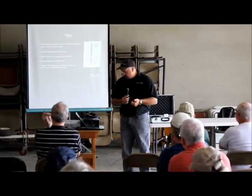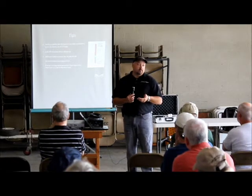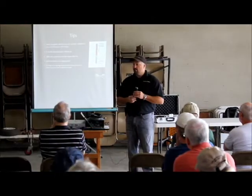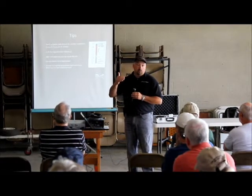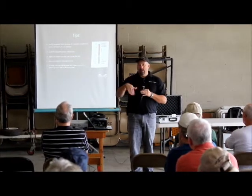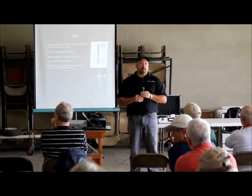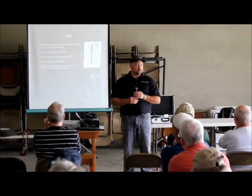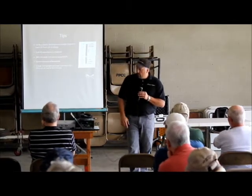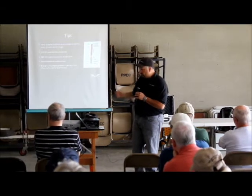1.2 ips is the FAA limit for a required static balance. So if you get an airplane that's got a 1.5 ips reading, that's a lot. I would go in and start doing all the tests — check the compression, check if the cowling is hitting somewhere. There's a whole list in the manual of things to verify. Above 1.2 ips is the limit — pull it off and send it somewhere if you can't get it down below that without changing things.